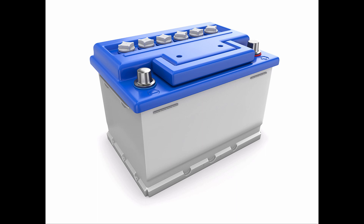We have a battery, and batteries are rated at amp hours. For instance, if we had a 100 amp hour battery and a kettle rated at 100 amps, in theory that battery should last us one hour. Different types of batteries have different limits. For instance, a deep cycle AGM battery, which is probably the most common house battery — you should only really take 50% out of it without causing the battery damage.